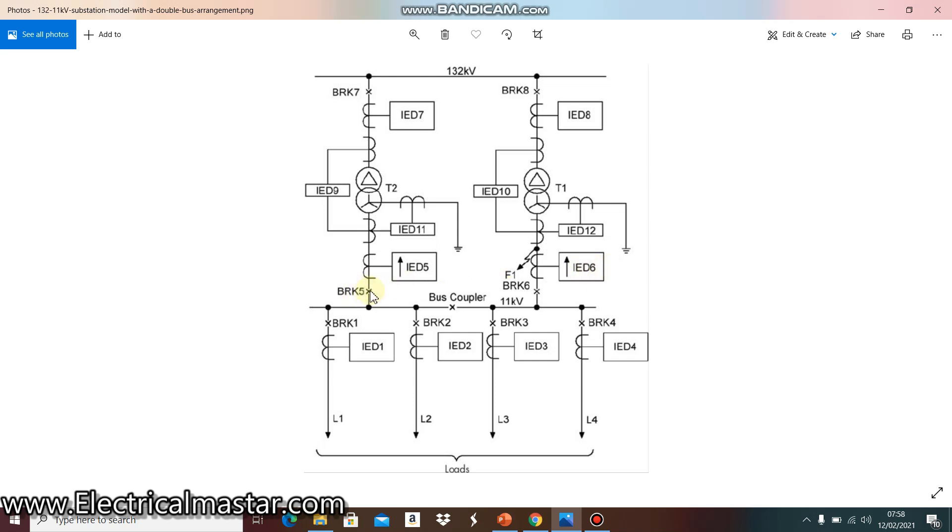The RCP panel has CT-connected electronic protection relays. The breakers and bus coupler are in the main switchgear panel, and the relays are all connected in the RCP panel. From the RCP relay control you can easily close or open these breakers. With upstream interlocks and earth switch interlocks satisfied, you can close the incoming breaker.